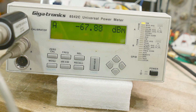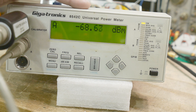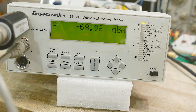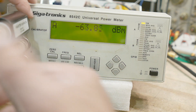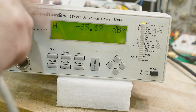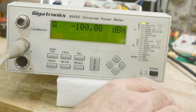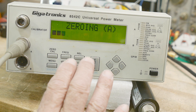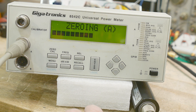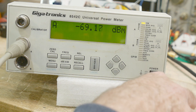Zero to minus 68 — that's pretty good. It's going to crowbar at about minus 70. So if you get close to minus 70 dBm, you've got a really, really good zero. Whenever you use a power meter, you calibrate it, and then when you go to use it you always zero it. That gets rid of all the DC offsets, because you're talking about really, really small values when you're using this thing. So it should come up right around minus 70 dBm. Minus 69 — okay, so that's working good.